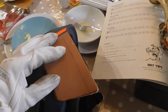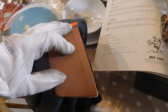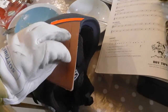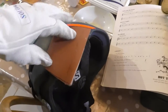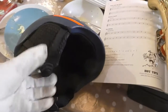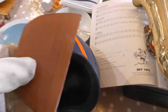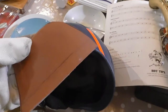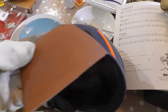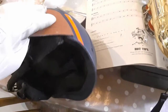It just sits right like that — no gap, nothing. Really nice. I've cooled it in cold water. Now, if I heat it up again I'll lose this nice fit, so what I'm going to do is use my heat gun to heat it up locally and bend just that piece that holds the camera. Otherwise I may have to make a wooden former at the right angle for the camera and lay it down — it goes like a thick sheet of rubber, like carpet underlay, kind of flops down heavy and just sits where you push it. I may need that wooden former to support it.